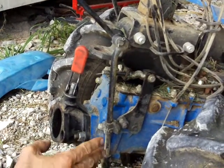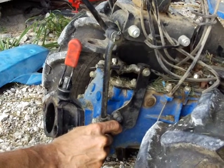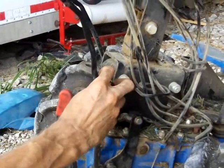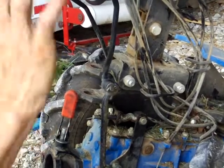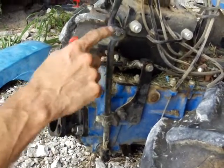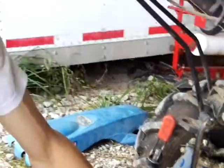What some folks will do is put their snowblower on, go to turn the handlebars around, find the swivel is frozen, and think maybe it was designed to flip over rather than rotate. So they'll bring it over that way. But this plastic joint has a little molded stop that's designed to dissuade you from turning it all the way over — it won't let you do that. Well, that doesn't stop people. They've got two feet of leverage and they'll just force it down, deform that plastic, and try to use the thing anyway. Of course, the lockout is still in the way, so it won't allow you to engage the PTO in forward mode. Now you've got to buy a new joint as well as get the swivel freed up. None of the shift rods are designed to flip over — all shift rods rotate around. Call us if you need any assistance.